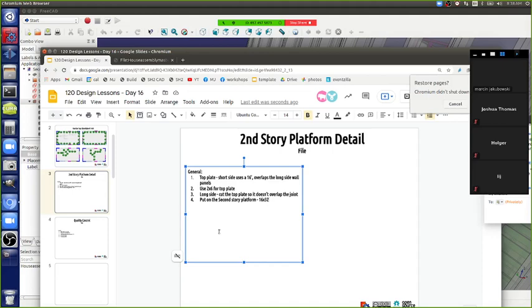Remember, we have one adjustment module, so we'll shrink that if we're over. We're not likely to be under, because all the modules are 4 feet, unless they shrunk, but I don't think they do. They can be a little expanded because of some misadjustments or warping, or maybe just a little larger. You've also got the sill gasket, which adds up over a number of sill gaskets. It's like 8 sill gasket thicknesses that you're squeezing together, which might add up to half an inch or an inch.